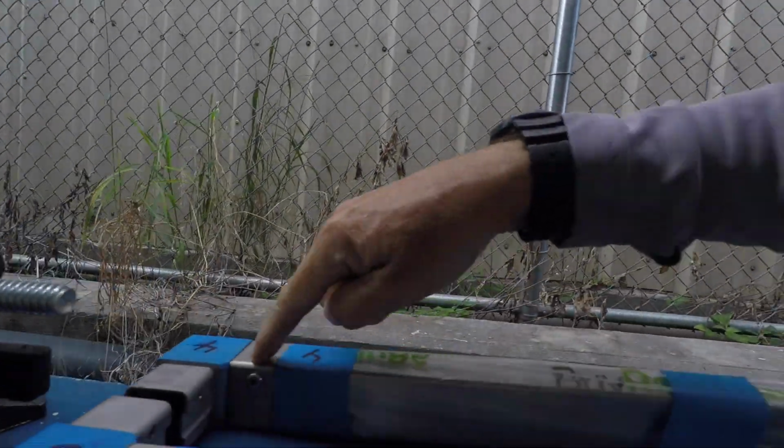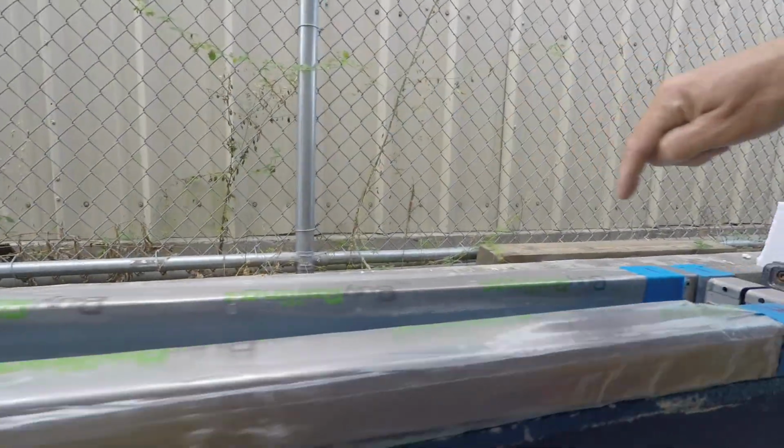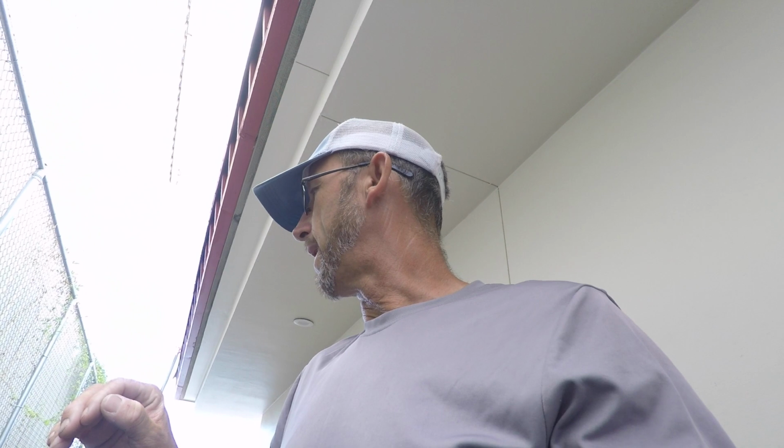We basically have every joint pop riveted. Those are basically going to serve as, for lack of a better word, a chicken rivet. The assembly probably would never come apart just being bonded together, but certainly between bonding it with the JB Weld or the Lido Weld and putting a pop rivet in each joint, this thing is never coming apart, and it's going to be super rigid, more than rigid, for what we need for this install. And if it was to have any flex in it, we could always put some legs or some stanchions coming off of the sugar scoops. But I think for this install, we are not going to have to do that.